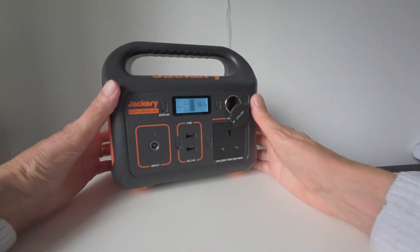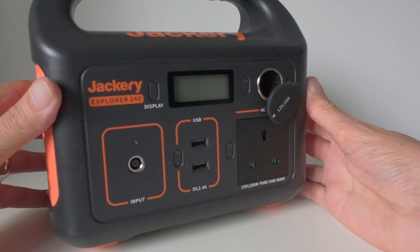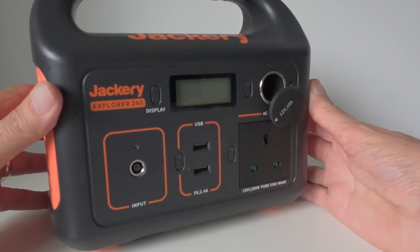It's not so powerful — it's only five watts — but if you use an external supply you get around about 10 watts, which is much more useful. When I say much more, it's another 3dB, which is worth having. That means battery operation. In the past I've used a Jackery power supply because it's pretty universal, it'll easily handle power consumptions up to about 10 or 12 amps, it's got a built-in 230 volt socket, and it's fine — but it's heavy. I thought, if I'm doing a lot of operation with my portable radio that has only a maximum power capability of 10 watts, I don't really want a really heavy battery.